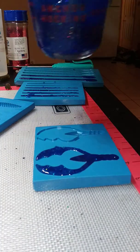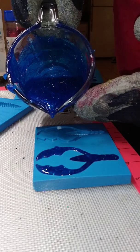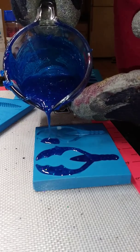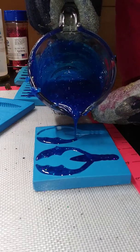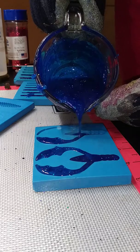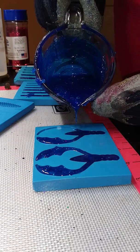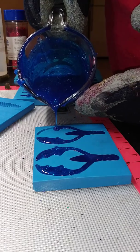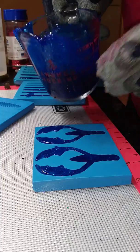Do another one of them real quick. Third of the way back of the claw. Let it fill in. Move back to the arm. It always drops in. Fill up the body. Once the arm fills up, run back to the other side. Stop with that third of the way back of the claw, and it'll fill itself up.